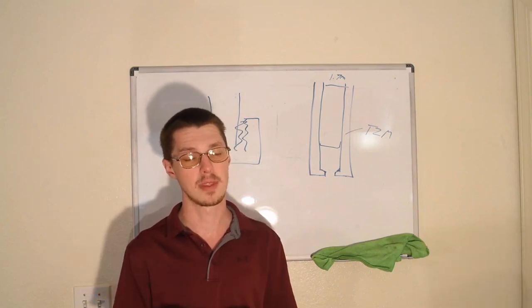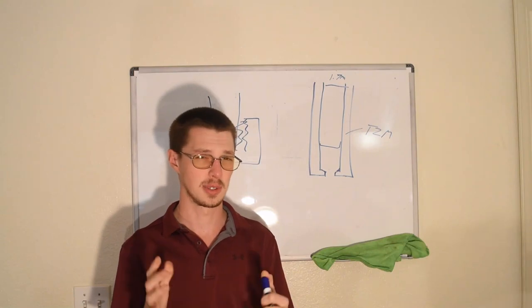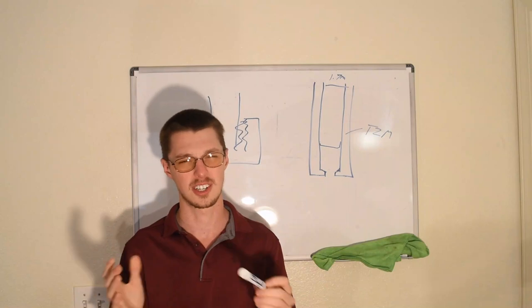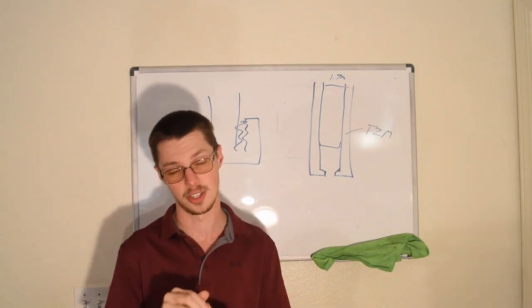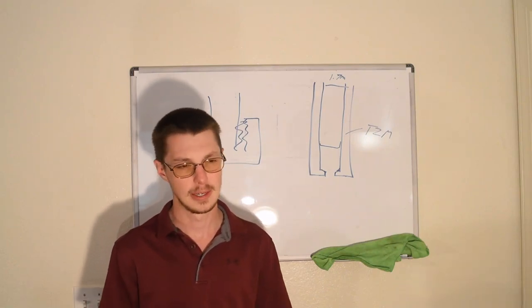So molybdenum both has the benefits of being in group 6, so it's hard, relatively dense, and has a relatively high melting point, but it also has the benefit of having a small overall atomic radius, and so it does not readily form bonds with other metals, particularly at the energies available to those atoms, or the energies available to the electrons around those other atoms at the melting point of most non-ferrous metals.